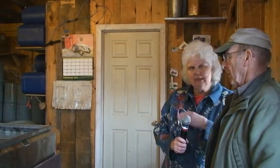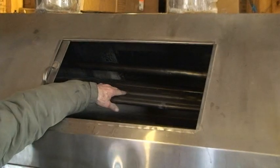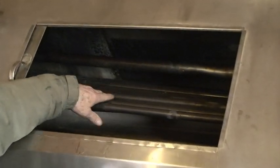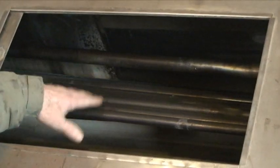Now I see you have, what was that, like four baffles in between separating it? Yeah, I never did explain the evaporator, did we? Today, the way I'm operating today, the raw sap is coming through the preheater up here, which is actually homemade. A fellow up in Vermont that I bought the system from, his dad is a sheet metal worker. He made all this top part. The raw sap actually comes in on this tube, and then it has to travel up through these tubes, and then it drops down on the other side